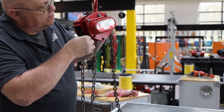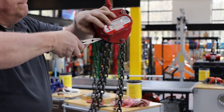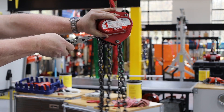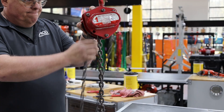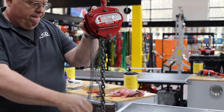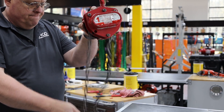The second way to re-chain your hoist is by using a zip tie or a piece of wire. For this example we'll use a zip tie. First, you'll need to remove the cotter pin and anchor pin as well as the hook, then pull the old chain through and out of the hoist. The hoist will need to be in neutral or free chain mode to do this.